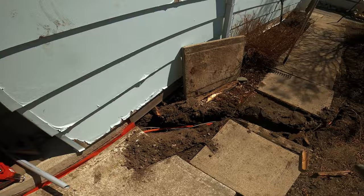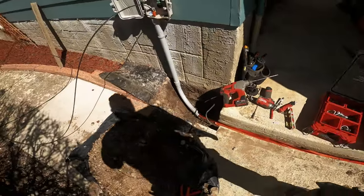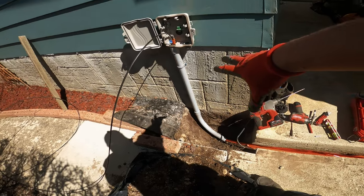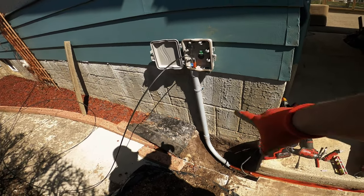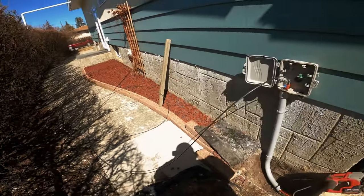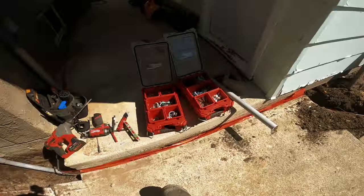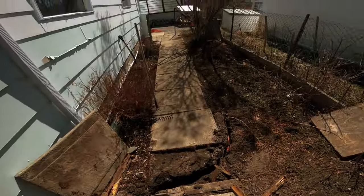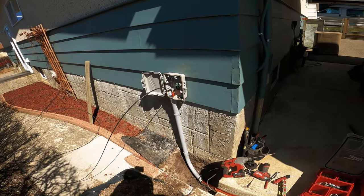We're just about done - still have to close this area up. We're doing a test fit and we got the elbow standpipe put up. I'm going to straighten up the conduit, put another bracket down there. We got the NIB in place and we got the drop pulled through - strip it, coil it in there, and backfill all of this. Overall it's a pretty smooth run.